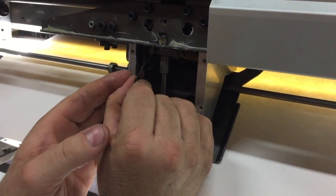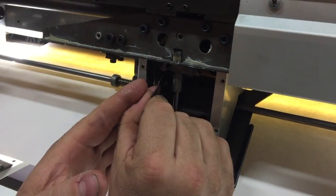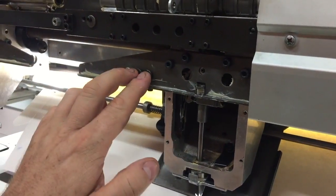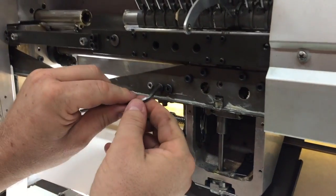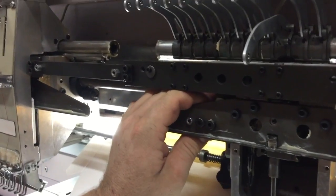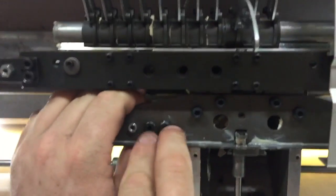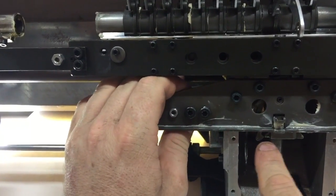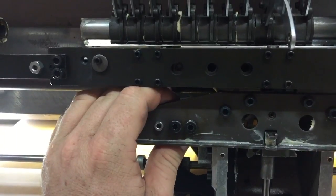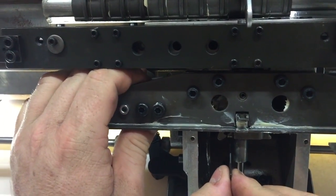There are a couple of things we need to bear in mind. One is that there's a gap between the nose here of about one millimetre — that is a setting we need to ensure we retain as we adjust. We also need to make sure that we don't twist off parallel the arm of the solenoid. Our adjustment is to loosen these two hex, which allows that plate to move in all directions and angles. You can see the nose is able to be lifted and lowered as I rotate, and also as I move left and right the tip of the nose is also moving. So where we want this to end up is for it to remain parallel, for this to be on its upper limit, and for this gap to remain around one millimetre, which just takes a little bit of fiddling.